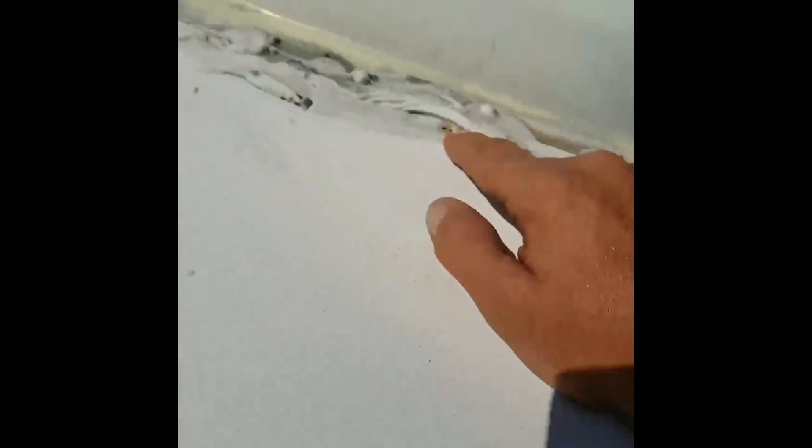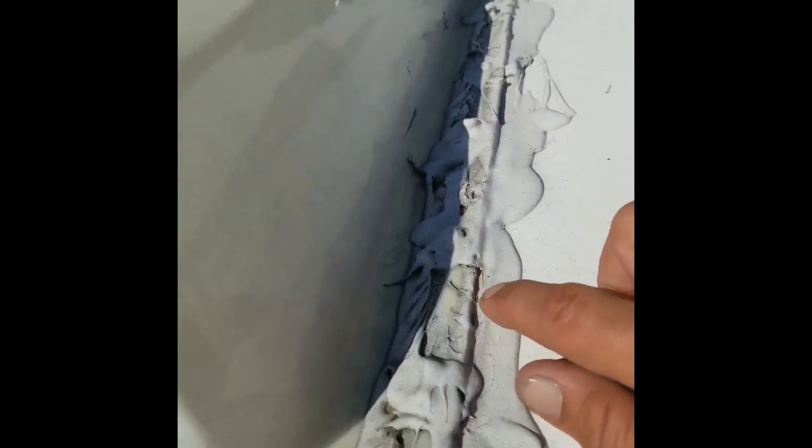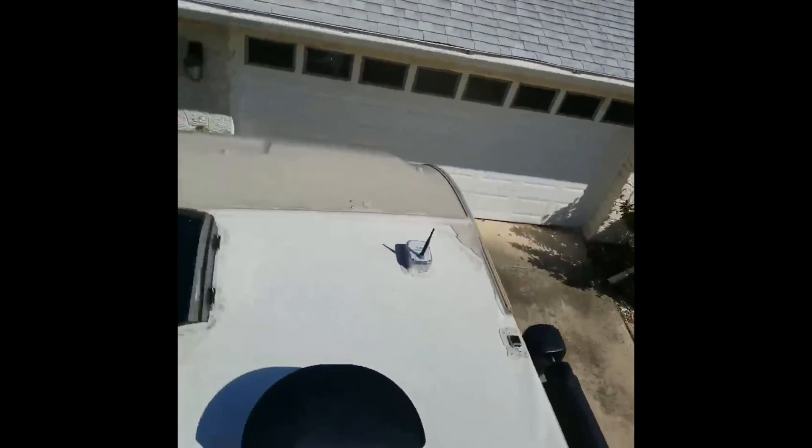This is just a quick inspection — we haven't washed anything up here yet. This kind of stuff is important. That is absolutely atrocious. This is terrible quality control — if I caught one of my employees caulking like this I think I would have to fire them on the spot. That's absurd — it looks like a bunch of chewed-up bubble gum. Is this typical of the industry? Because over time it cracks and that's where water is going to seep in. If you have a warranty or just bought one of these, I would consider taking it back and having them reapply some sealants. You could also do it yourself.